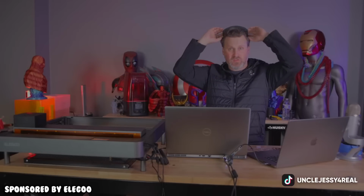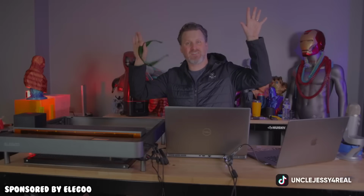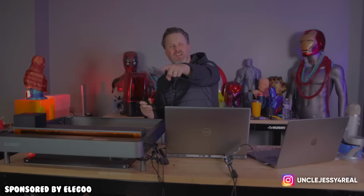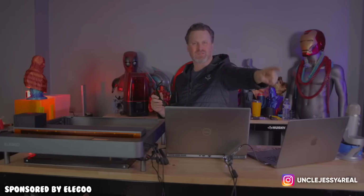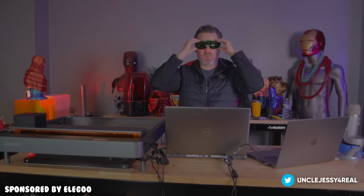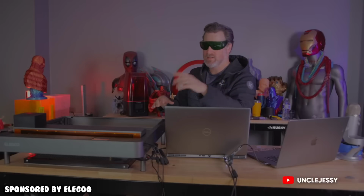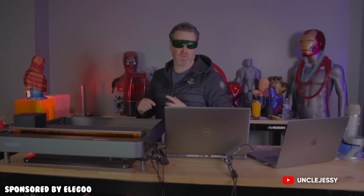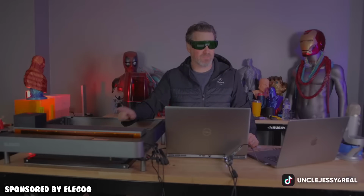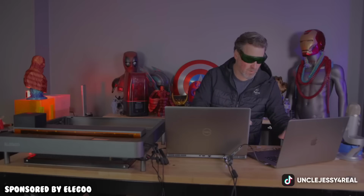And anytime you're doing any laser engraving, you want to make sure you're working in a well-ventilated area. The reason I'm wearing a jacket right now is I have windows open. It's cold in here, and I've got fans running. I've got a big box fan. I've got my air filter system up and running here as well, and the filtration system running on this. You're also going to want to make sure you're using the protective eyewear that comes with the unit, which is great, to protect your eyes from any offshooting of the lasers. Even though there are acrylic panels on this that should help, you definitely don't want to be looking at any of this while it's cutting. You don't want to go blind or anything crazy like that while working with this.